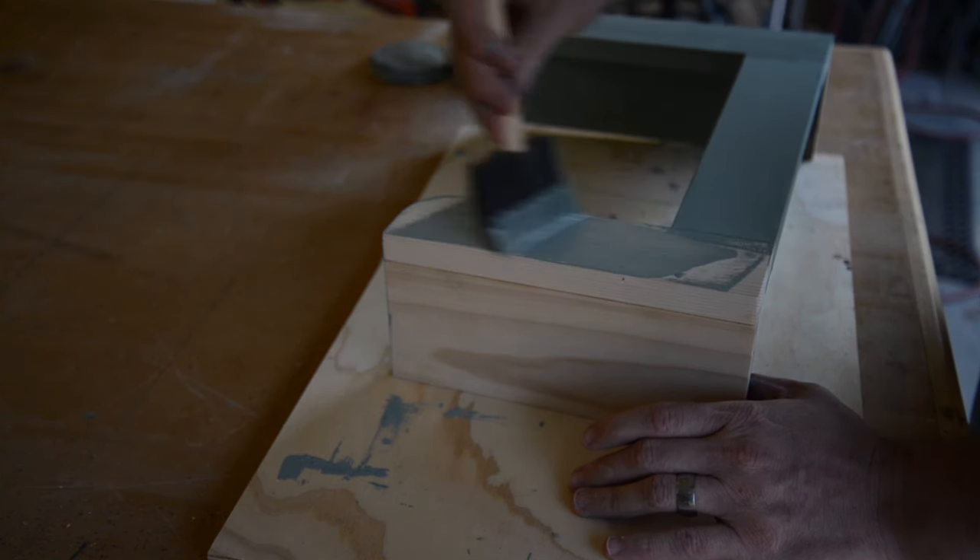There were a couple of changes I had to make along the way, and I've updated the plans. Make sure when you measure that you account for everything that might get in the way. There's actually a cleat at the bottom used to attach the cabinet to the wall, and I had to take about three-quarters of an inch off each foot on the stand. Also remember, if you use shelf pins, they'll take the width down about a quarter of an inch. If you use my plans, all the dimensions are correct and the shelves will fit nicely. Otherwise, take really good measurements and fit the plans to your own cabinet.